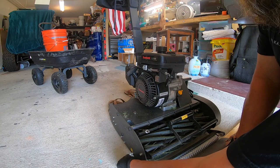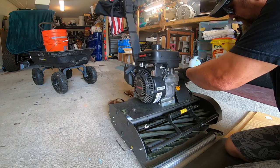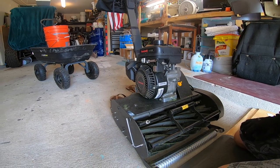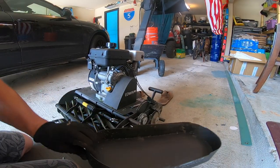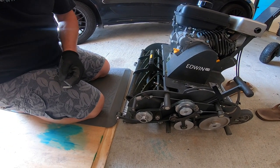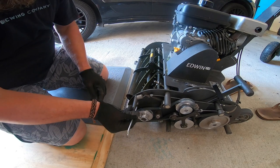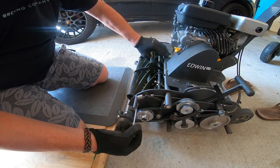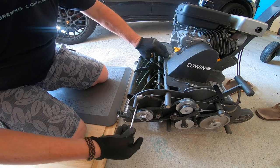So to change the reel, put the reel all the way up so it's elevated. Lock it in place on that side. Take your Allen wrench and just loosen it right here. On this side you've got to take off the cover — it's magnetic, super easy. Put your screws inside there, put the screw down here. Get it loose, put the key in, turn it. If it turns a little hard, just lift up on the cartridge a little bit — that loosens it up. Same thing when putting it on. The holes line up but they're tight.